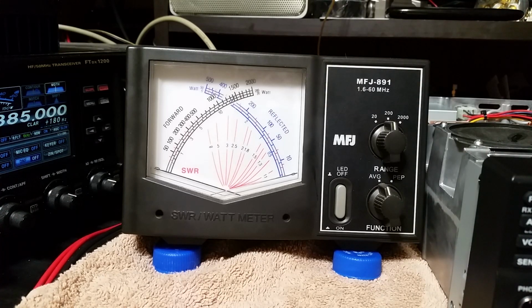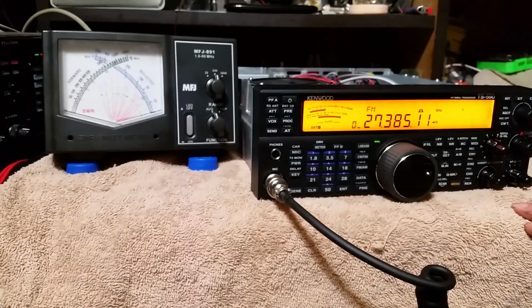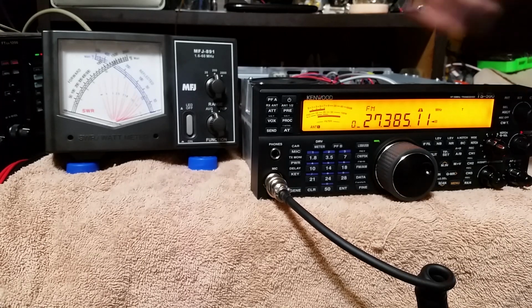we're going to need to play the ALC game, which I don't mind doing. Kenwood is not too forthcoming with giving you enough information on how to do it. But I think I got this under control. It's a simple thing of finding IC 802. 802 is where the RF gets sampled off the PA deck back down to the logic board where the CPU is, and then it pulls the RF back off the RF deck at a set level, whatever Kenwood sets it at, which sucks.